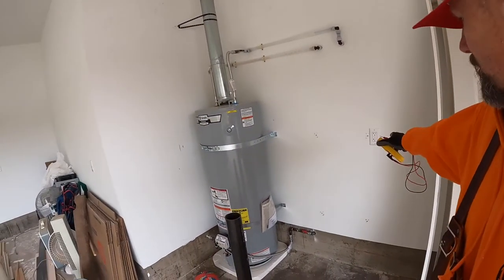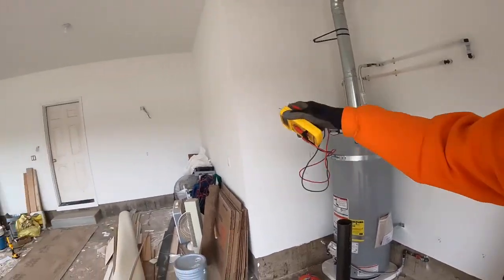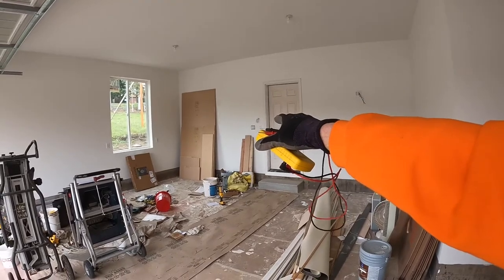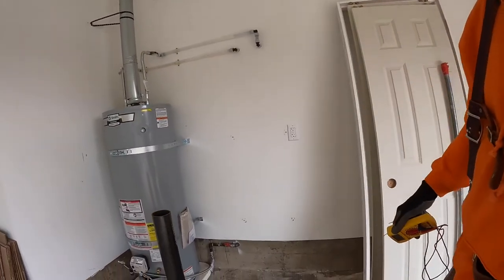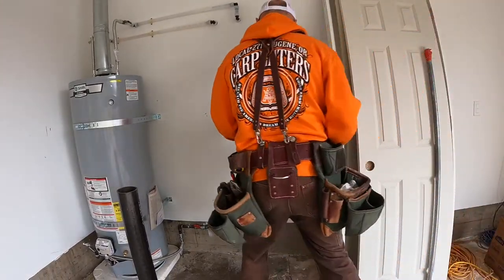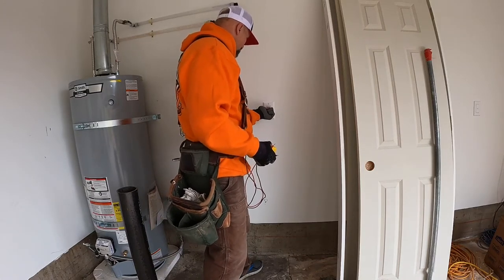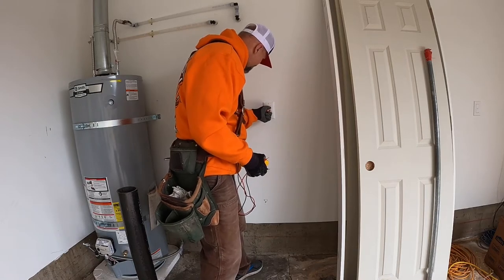So this is the start of my run. It's a GFCI. I'm gonna trip that and it should turn on the other ones except for that one over there. That's a breaker all by itself for the freezer and refrigerator over in that area. So turn this on and then I can check it. First off, seeing if it's got power, which it doesn't. Which is good.